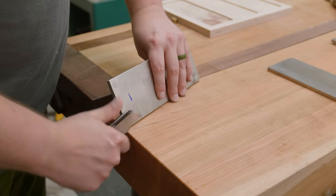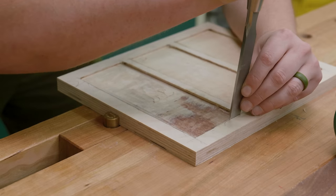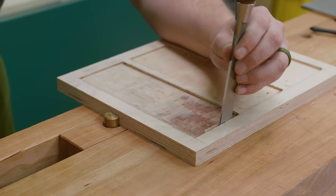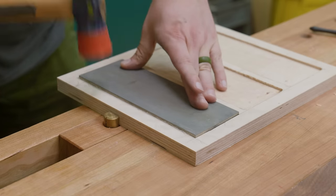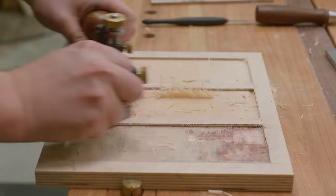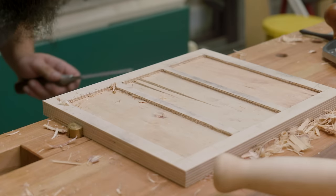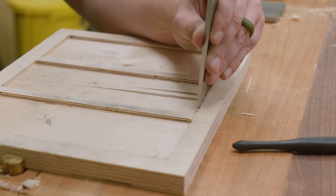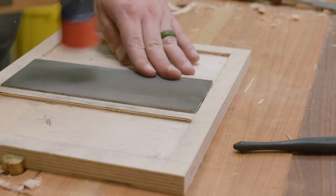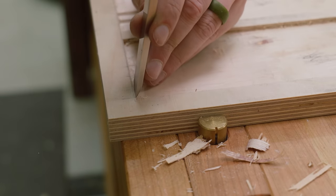The next step was to cut off the little rubber feet that come on the bottom of the plates using a razor knife. From there I'll use a marking knife to mark out the top of my plates and then a chisel to clean those up. I decided to make the adjustments for the plates at the top of the plate holder, but you could do them at the bottom — just try to keep them all to one edge so one side of your plate holder is clean. I went in and used my router plane to clean up the bottom of all my mortises, giving me a consistent depth and a smooth surface for the plates to reference against. If you like woodworking tips, tricks, and projects, make sure you subscribe so you don't miss the next one.